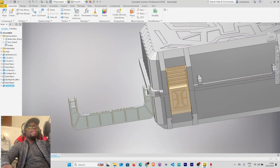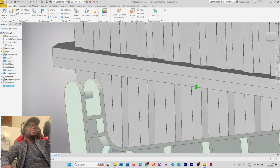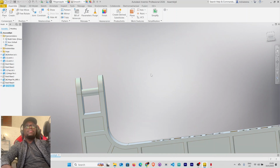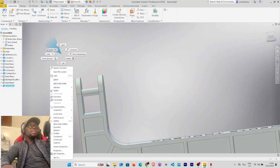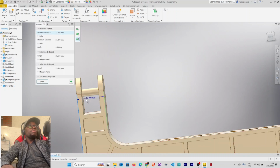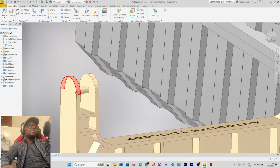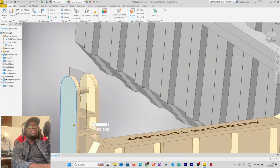All right, we want a work plane in between this, so we know that the distance, okay, let's not assume, let's measure it again. Measure from this to this is 12 millimeters, so we want a work plane that's 6 millimeters. Right, so select this work plane, left click from this face, moving it this other way. You can simply type -6 millimeters, click OK.